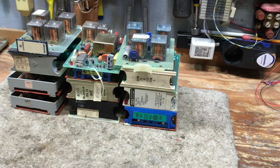Once again, these all perform the same exact function, and they can be interchanged on any 1A2 system amongst any of the manufacturers. If there is any variation, it would be slight. There are options to be set on each and every card if you want to change them from the original factory default options. At that point, you would need to program that specific line card.